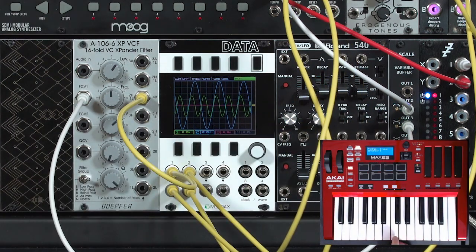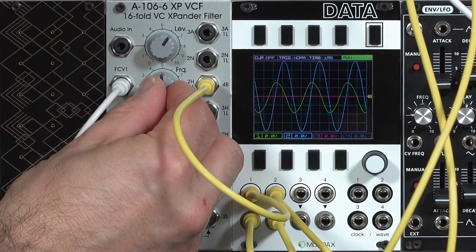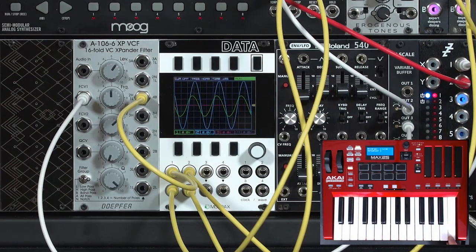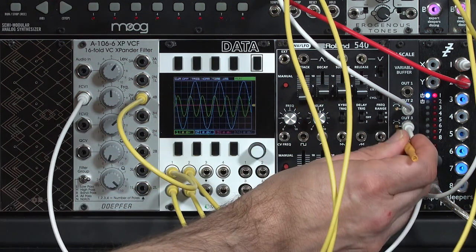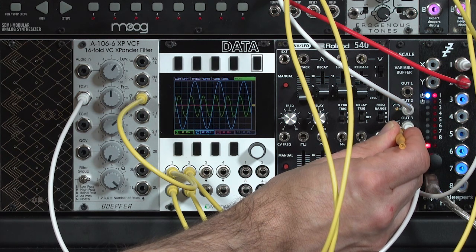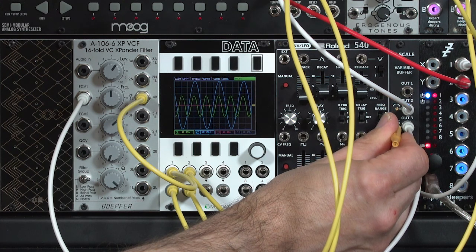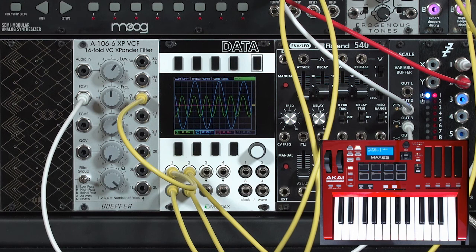That's very good. Let's go back to middle C — very close, just a little bit out down there. I'll tweak the filter's cutoff, which is its oscillator frequency in this case, to get it back in tune again. Then go up one octave and make another fine adjustment. This is quite an iterative process where you need to keep going back to your reference pitch and then readjust at the higher pitch. There we go — no drift and we hear no beating.